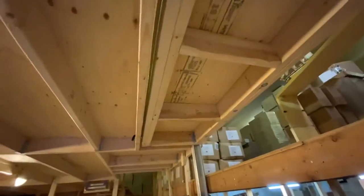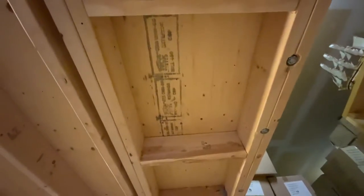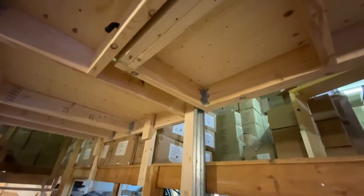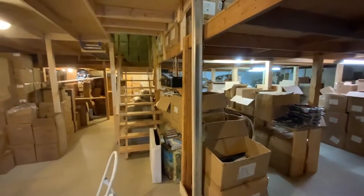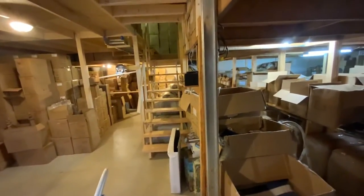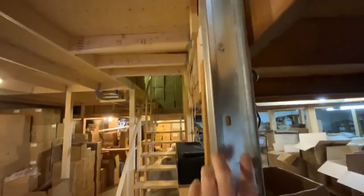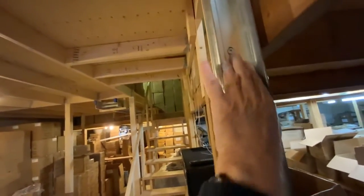I double-framed it — that's two-by-sixes. I've got steel rods, you'll see them upstairs, coming through there with a nut and a washer. I indented those so they wouldn't hit my cement floors. I also secured the back corners. I used garage door hardware — that is a three-inch track. You can get two-inch tracks too, which will be fine, but I used a three-inch. You want a tapered head screw so that your wheel doesn't hit that screw.